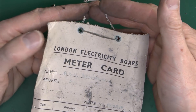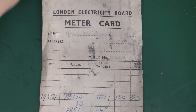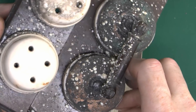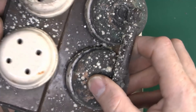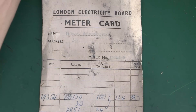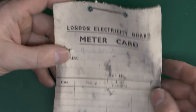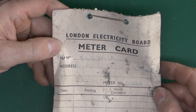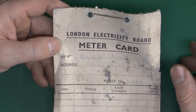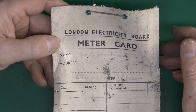A little bit of string there would obviously tie it around the fuse box. And even by 1952, this sort of thing was already pretty much obsolete. So this is considerably earlier — probably 1930s or maybe even older, certainly pre-war. But of course, like most things, just because new things are available doesn't mean people necessarily replace them. They'll stick around for a surprising amount of time. And even today in 2021, there are still installations out there which have rubber cotton-covered wiring, even though it hasn't been in use for over 60 years.